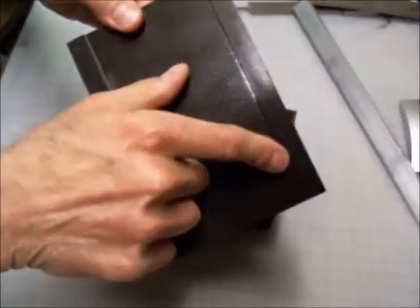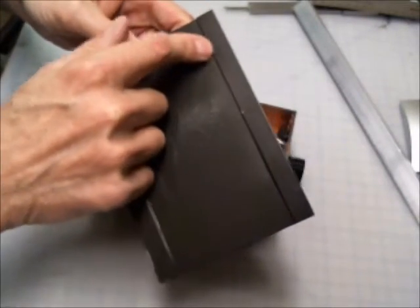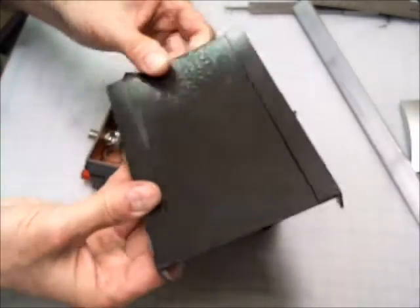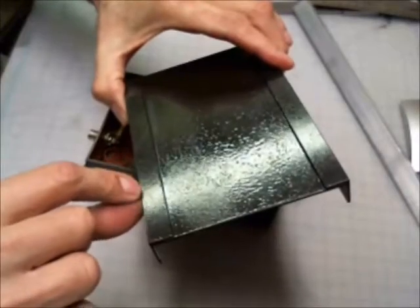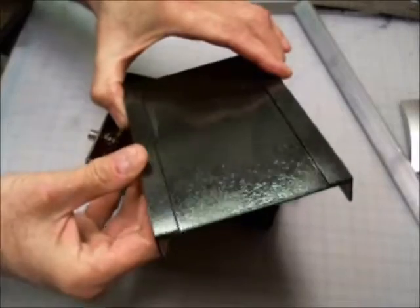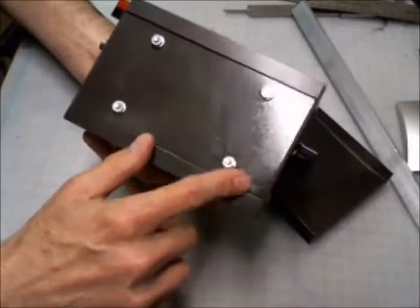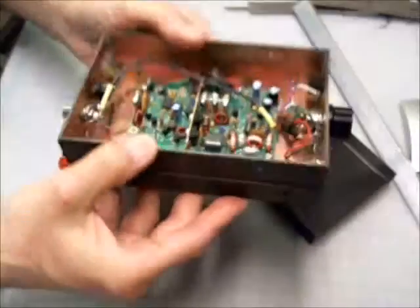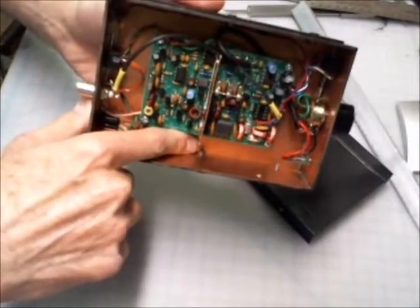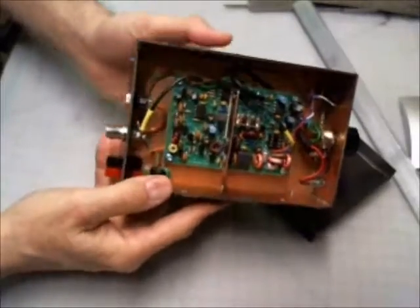On the lid, I just glued it with super glue — a gap-filling type. I don't think I would do that again. Even on these narrower sections, I would supplement it with pop rivets, because I've had one of these come apart on me and I don't think I'll rely on glue. I'm not a huge fan of pop rivets either — they leave a large thing sticking out inside the box.